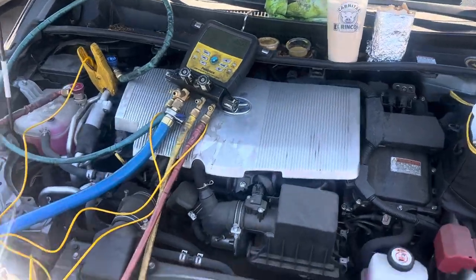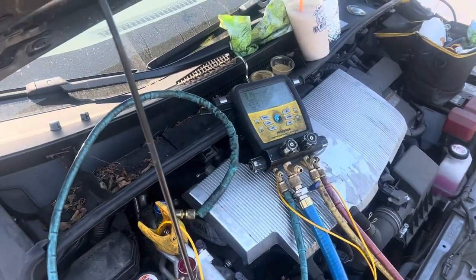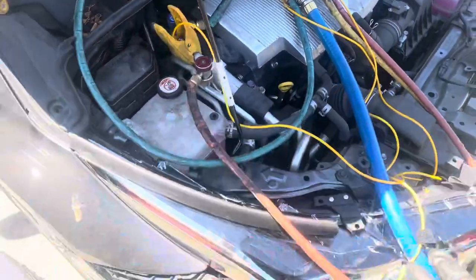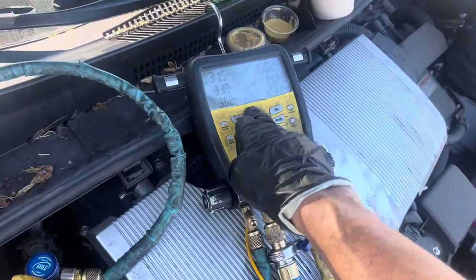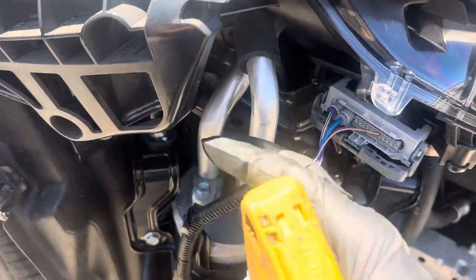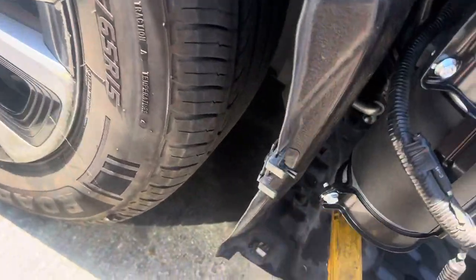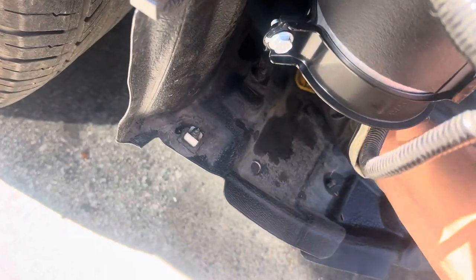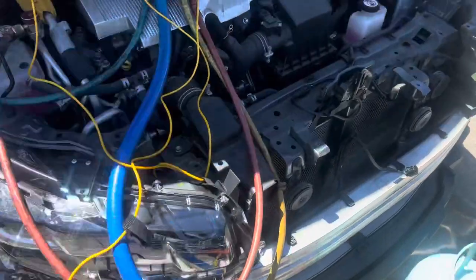I'm done — I'm behind schedule and had a customer call me up prior to this video asking if I'm going to be on time. I'm going to be a little late, but I wanted to get this out to you. Let's take it back — the compressor discharge right there is at 141 degrees Fahrenheit. You can see water forming right here on the suction line, which has definitely cooled. Taking some temperature — it's a bad connection, it's on a bend, it's not correct, it's going through a muffler because I can't get over there with that one.